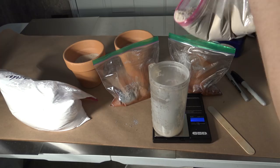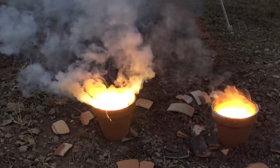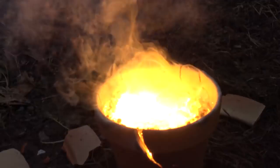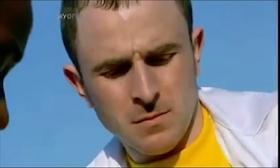possible. Next, we're going to have to come up with a reaction vessel that's strong enough to withstand a 3,000 to 4,000 degree temperature change within about 10 seconds, and not spill the contents all over the ground, while at the same time be cheap enough to be semi-disposable. Yes, the answer is... the slow-release mechanism of a garden flower pot. Cheap, disposable, and available almost anywhere, there's a reason they're used so often.